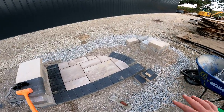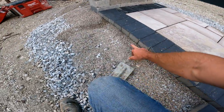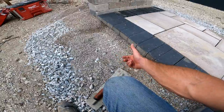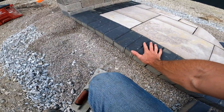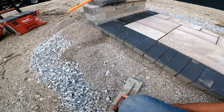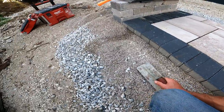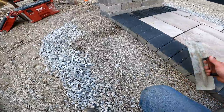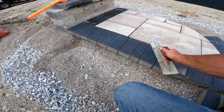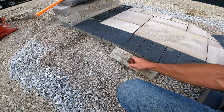So we went to using concrete edge restraint. About the only drawback is that if you put too much concrete in there, your turf is going to have a harder time growing. I'm more concerned with a solid paver edge than that. And I don't even believe it's necessarily the concrete so much as the issue being your base — this dried base wicking moisture out of the soil, then being heated by the sun. It's just a tough place for turf to grow.